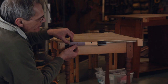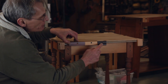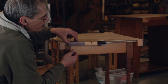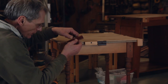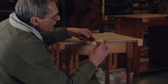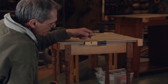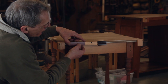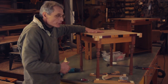The various colors create an almost patchwork approach. The center piece, the keystone piece, is a little proud and has a profile to set it apart. In order for these pieces to look right when they come together, I just used sandpaper and eased the edges ever so slightly to give it a transition shadow line — a little groove right there. The finished edges will look something like this.